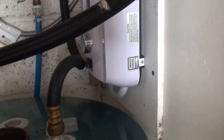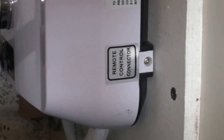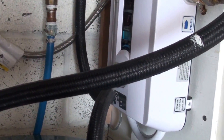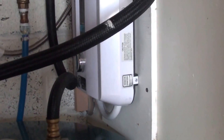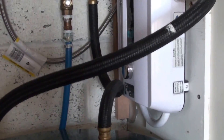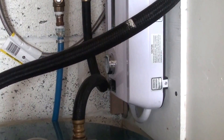It does have a setup for remote control, but it's a hardwired remote control. You could take the remote and have your digital readout right in the bathroom, adjustable so you could set the temperature right before you got in the shower. My house is small so I just walk over here and check if it's set at 105 for a shower or 120 to 125 for the dishwasher.